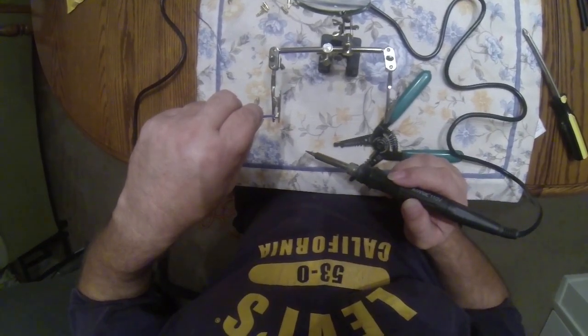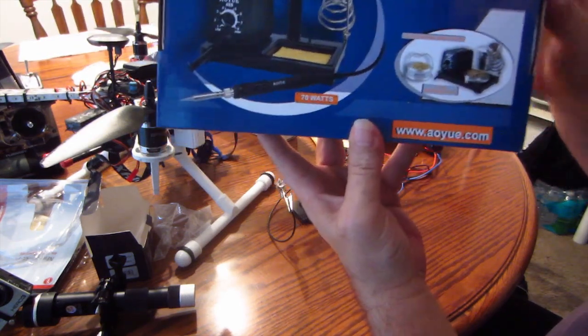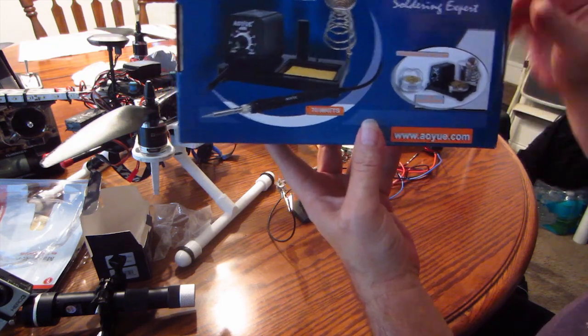In order to get the helping hand as an add-on item, I had to buy something else, and I said well, what the heck, I'll get that too. It was about $20 to $29 on Amazon and they delivered it the next day — that's a win. One thing I learned along the way is there are different types of flux. Flux is just a material that helps solder stick better. I almost made the mistake of getting the wrong flux — the stuff used for plumbing will corrode wires, and you don't want that inside your ESC because that's crash city, baby. What you want is rosin flux — that's the electrical kind. I have that coming tomorrow, but I think I have rosin solder anyway, which is another way around it.